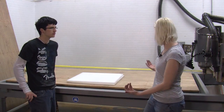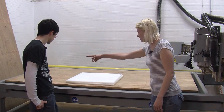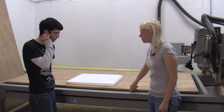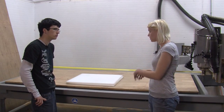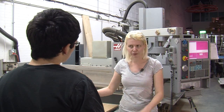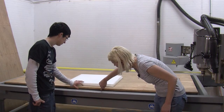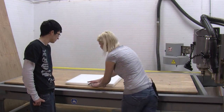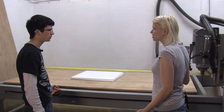So what we have to do is I have this half-inch router bit, and we're just going to run it along this edge and that edge of the table. Because the plastic part underneath is perfectly square to the table, but we don't want to cut into the plastic, so we put a piece of wood on top of the table as a scratch board. Last week I made a huge mess on my scratch board, so we put a brand new one on today and it's not quite square. We could do this with the program, but it's easier just to run it manually.